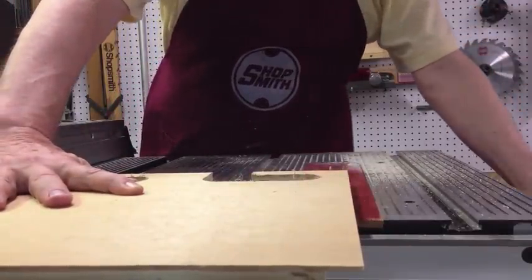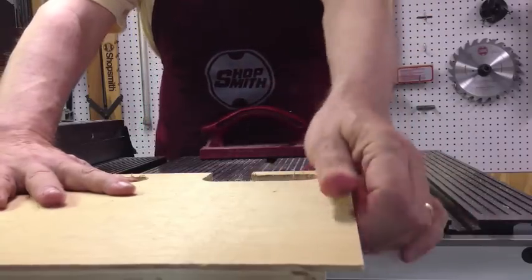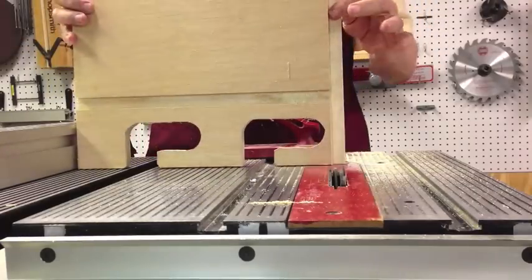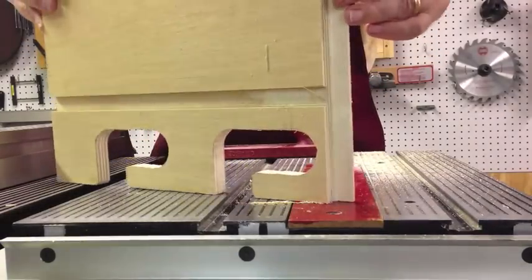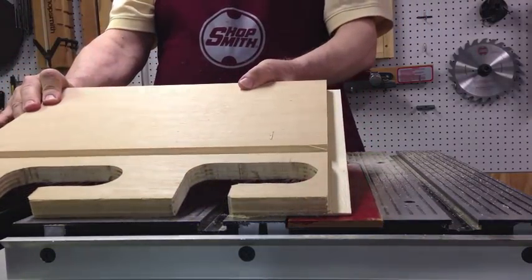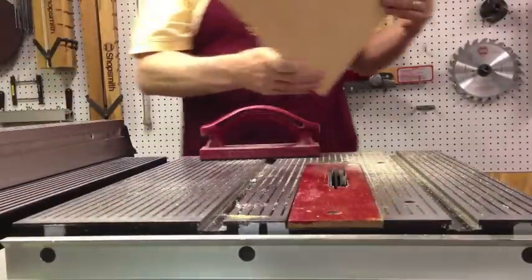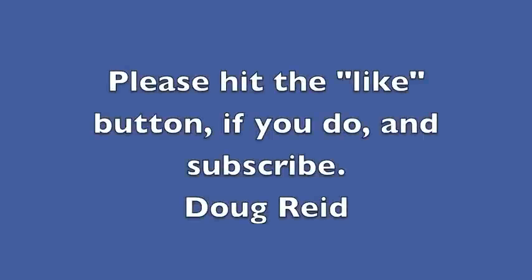I'm cutting about five-eighths of an inch deep and about three-quarters wide, and it just powered right through without any problem. The PowerPro is just a much nicer tool to work with — it gives you that extra heft. Now, I don't recommend you take that deep of a cut; you're better off to do it in two different passes. But it does a beautiful, smooth job. It used to seem like I would have a rougher cut with my dados, and the PowerPro seems to make a smoother cut. If you like this video, please hit the like button, leave a comment, and please subscribe. Thanks.